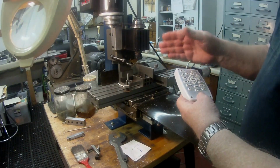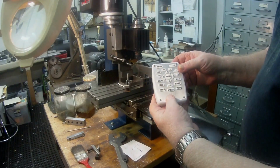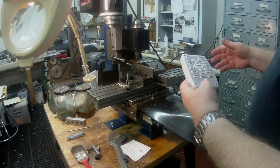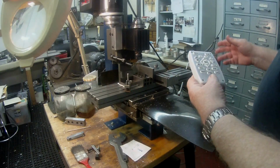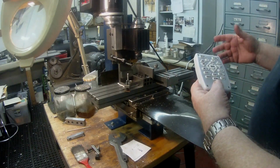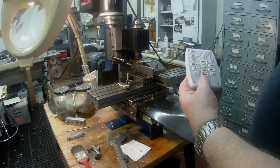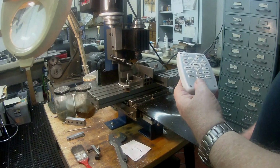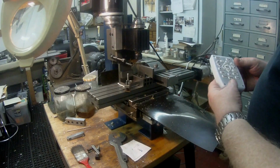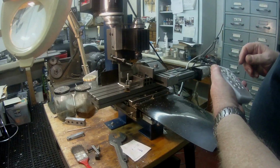I'm just progressing my centers along according to the cam layout, and it's just a simple thing, but I find that turning the handle and trying to add 0.437 to 0.687 on the dial can get confusing. So I'm using this along with the CNC stepper motors to do my pitch. I've got one more that I have to do.